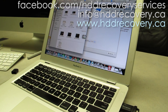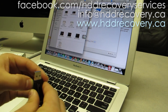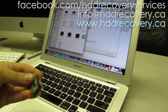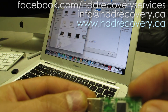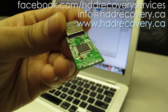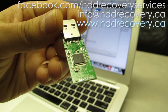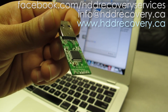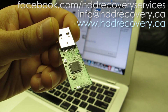Even though it's plugged in, nothing is coming up on my devices. So I'm going to eject it and do the tabs. Here's what we're dealing with — this is a little bit better to see what's going on. Right off the bat I can see a few pins on that connector are lifted. This is not a traditional 4-pin USB connector; this is USB 3, so we've got nine pins on it. We're going to have a look at it underneath the microscope to find out the extent of the work involved.